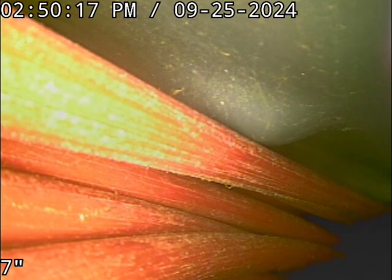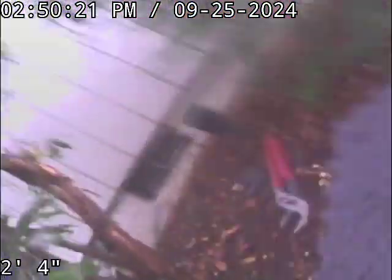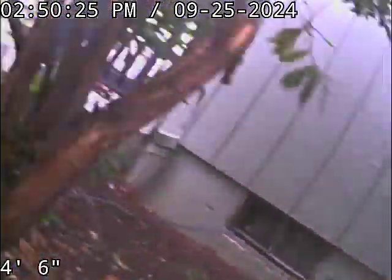We're just around the corner from the front patio. This is not one of those clean-outs you should ever lose track of — it sits almost perfectly in front of the first foundation vent, just barely offset to the right of it. This is a 3-inch ABS clean-out. We're going to check the overall condition and serviceability of the sanitary sewer line.